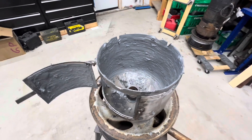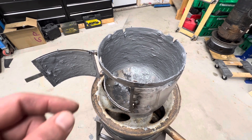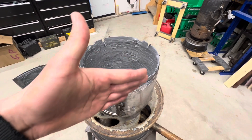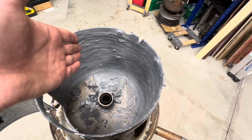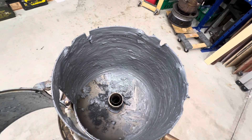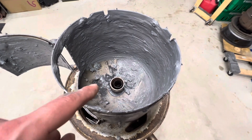I am done for today — I did get the refractory cement spread along the interior of the combustion chamber. The best way to do it was to thin down the cement a little bit with some water, mix it in the container it came in, and then just use my hand to spread it out on the inside of the tank. I don't think there's a tool that would be better for this application — it's such an odd shape inside that getting the curvature and the bottom where it curves down, you really need to use your hand to get the cement to form to that shape.